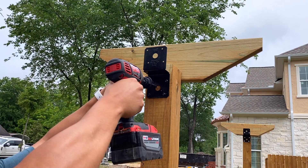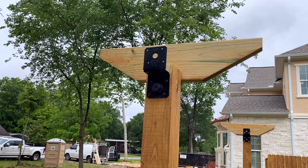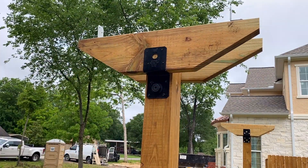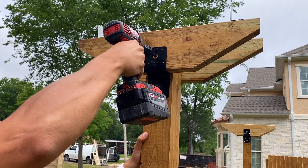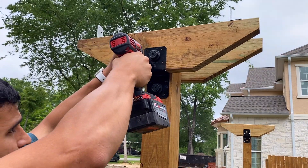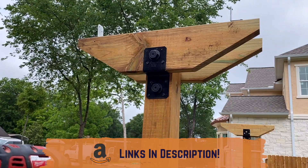As you can see, I already attached some of these horizontal supports using joist ties. I'm using hex head washer screws from Strong Tie — they look like really big bolts, but it's just a washer with screws that you screw right into place and it secures everything really nicely. I'll be including links in the description so you can check those out.